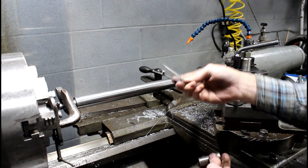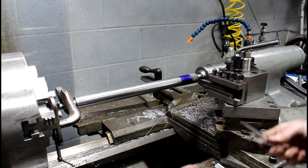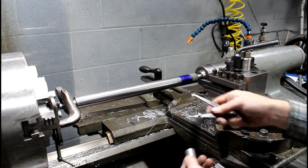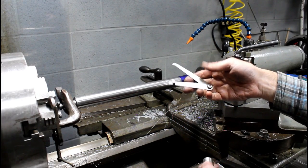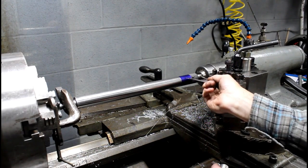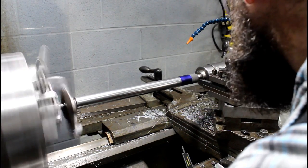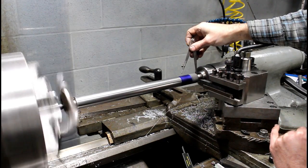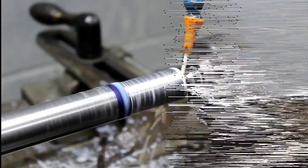And these are really good. You don't want to use your good calipers, electronic, digital or dial calipers, to scribe those lines, and that's what these are for. So, little Brown and Sharp 835s. We're just going to do a rough layout here, and that's it. Got a little extra foot here so we can touch on the end of the shaft, come in, and make our line.